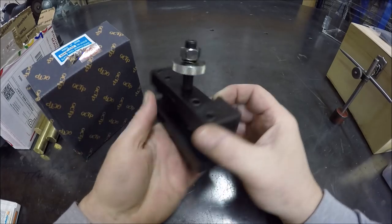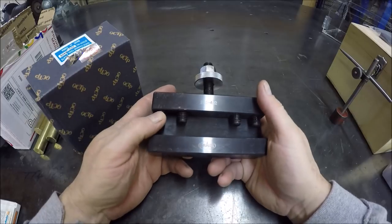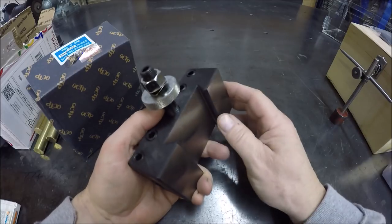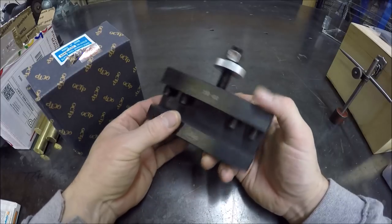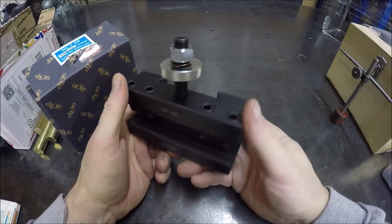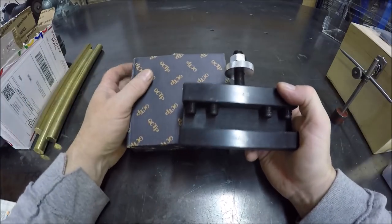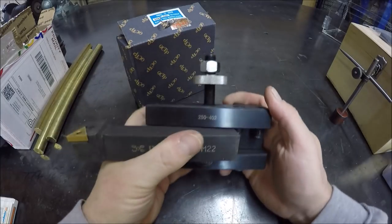To go with the theme, I picked up a couple of big tool holders from Shars. These are CAs. I have a Dorian tool post — it's like a turret tool post where you can get four tool holders on it. They require special Dorian tool holders which are pretty pricey, even on eBay used. Somebody on a forum mentioned that standard CA holders should fit, and he was correct. So I'd rather buy these at about $26 a piece than the Dorian's which sell for over $100 new. I grabbed two and this one will slide right in — one holder filled.